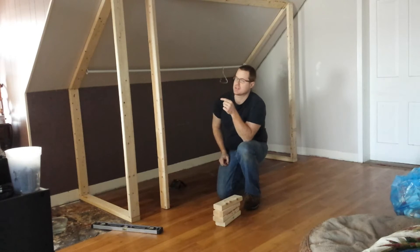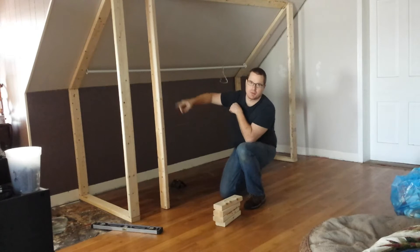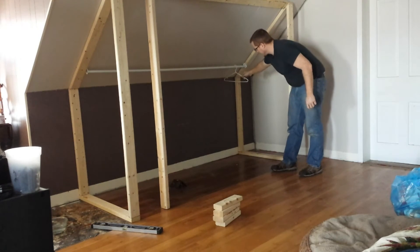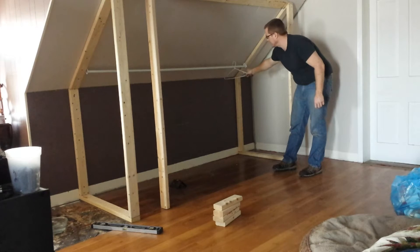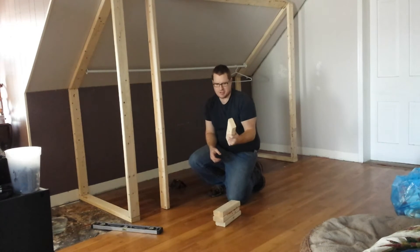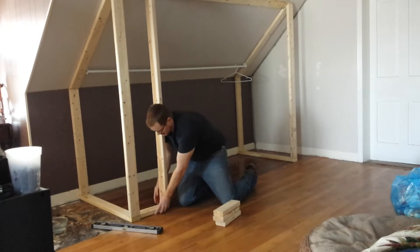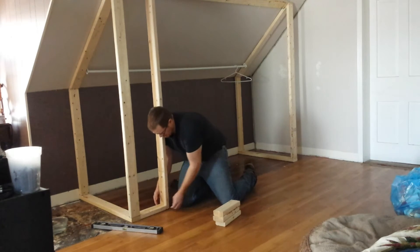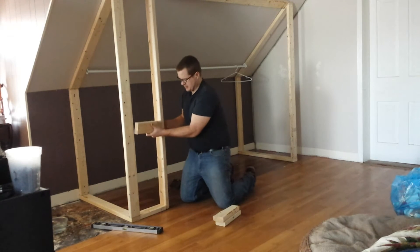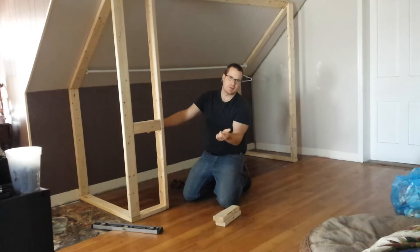Now that I got the two frames done, I went ahead and measured the same distance up on the back end and just set up our temporary pole. We just simply did that by seeing how a coat hanger fit on there. Then I cut these just-under-11-inch pieces, and they're going to be the separators on the way up. That'll give it exact spacing plus something to screw the drywall into and our shelving on the inside.